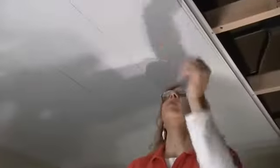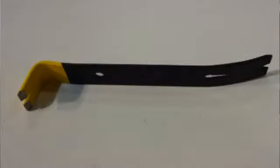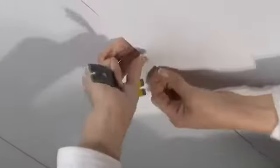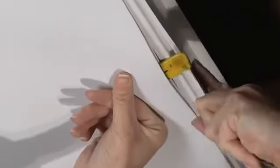One of the great features of the Zip Up ceiling is that it's actually designed to be removable, so you can access it to put in accessories like lighting, or for maintenance like plumbing or electrical work. To remove a panel, you're going to push up in the middle enough to create a gap that you can slip a flat object into — I like to use a mini pry bar, but you can use anything with a strong straight edge. Slip that inside the gap and gently pull down. Do that on both sides — give it a gentle pull down, create a gap, and gently pull down from both sides. As you saw, it's easy, it's fast, and it gives you a nice clean look over traditional ceiling systems for years to come, while also providing accessibility to wires and water lines for future access.